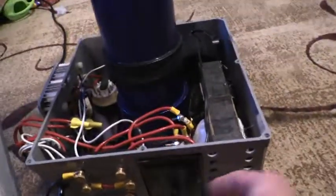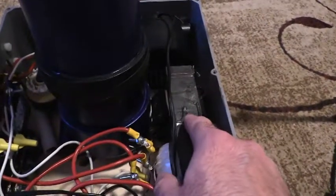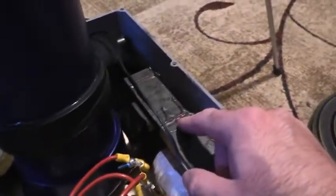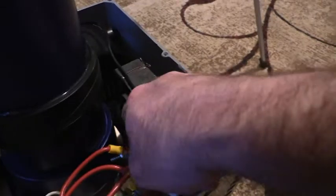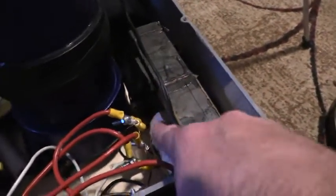The power comes in through the switch to a homemade low voltage high current transformer I made out of an old 15kV 30mA neon sign transformer. I removed 40 turns from the primary, left one magnetic shunt, and removed the high voltage secondaries.